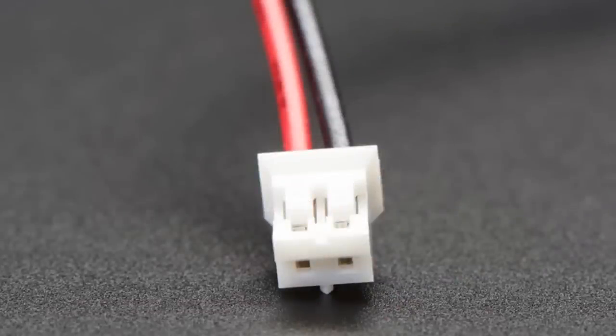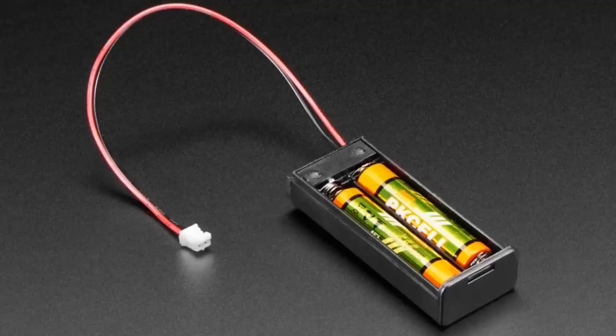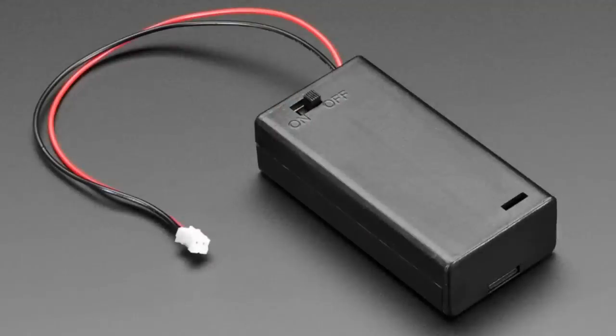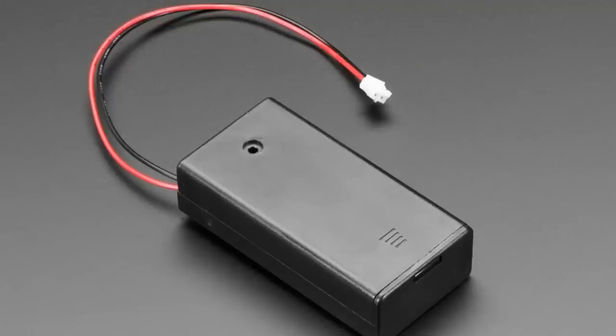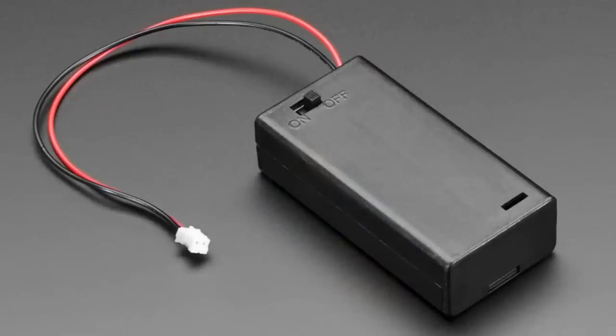We have some dual battery packs. These are two AAA batteries with an on-off switch, and the on-off switch is really nice. This is specifically for people who have micro:bits, because a micro:bit specifies only running off two alkaline batteries. But that battery pack doesn't have an on-off switch, so you're supposed to yank the JST out — but it can get stuck, kids are a little bit rough, it can rip out and damage the battery or possibly the micro:bit. So these are a little bit more expensive, but they have an on-off switch, so you just flick it off when you are done.